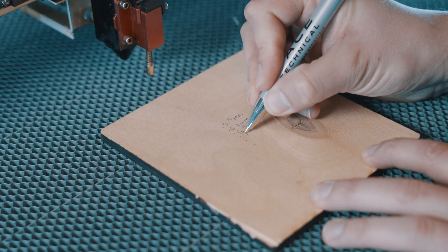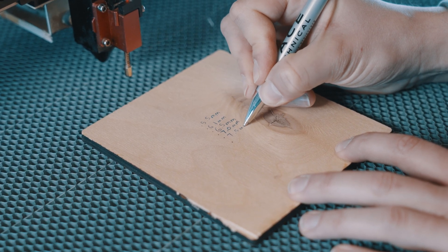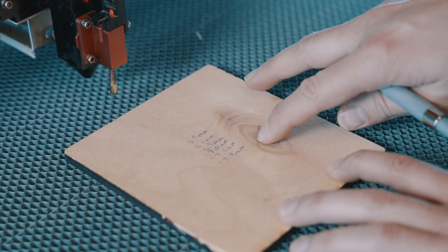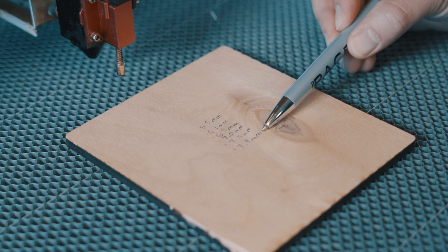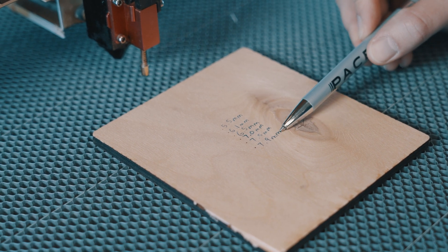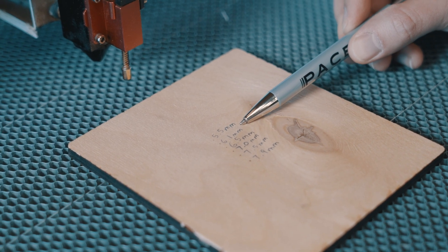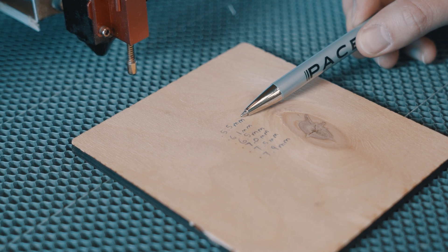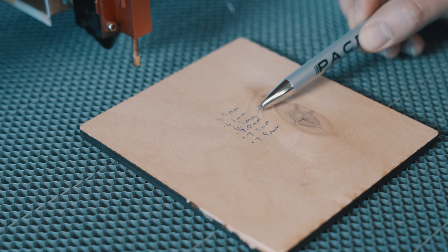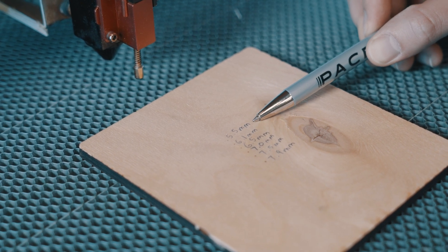Writing in our values for the other three dots: we had 7.0 millimeters, 7.5 millimeters, and 7.9 millimeters. Now we're going to analyze these dots. Looking at the furthest distance from the laser head, the dot is the biggest — that's definitely not what we want. As we reduce that distance to the lens, the dot gets a little sharper. It's looking like our value is going to be somewhere between 5.5 and 6.5 millimeters. Since our starting point was 6.5, it seems we do need to adjust and reduce that distance.